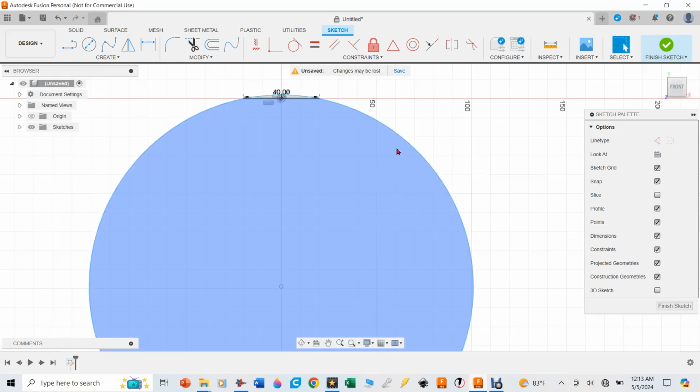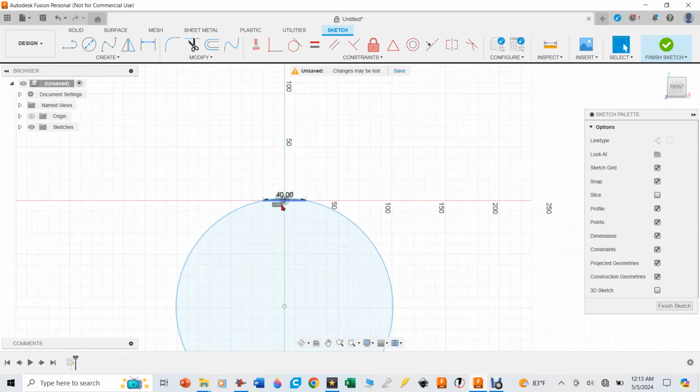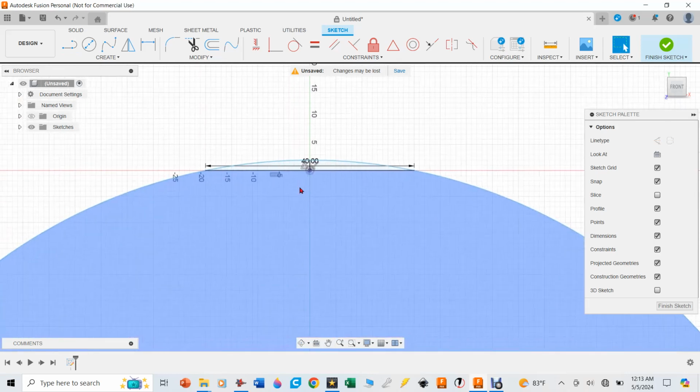All right, so one other thing we need to get out of here, the last dimension, is this: with Bend-Tech, when you make a bend, which is basically what we're doing here, you have 2 straight lines, and where those 2 lines meet, which are tangential to your circle, in this case, that is where you're going to put a pick point, and that's how we're going to define the circle. Basically, that center pick point is where the bend is going to happen, and it's usually outside of wherever the bend is going to be.